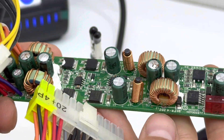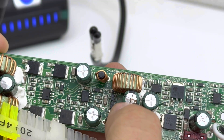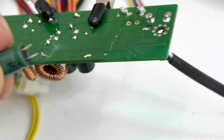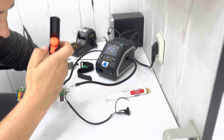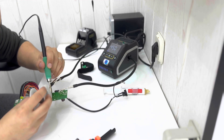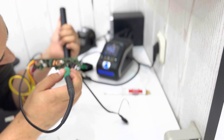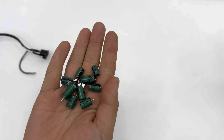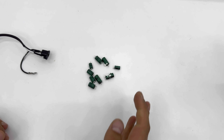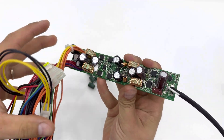Checking the board in a bit more detail, I could see that some of the capacitors were rusty and slightly bulged, so since there were only 10 of them I decided to spend some time desoldering and replacing them with brand new ones. These were unfortunately slightly larger but of correct specs. After retesting the voltages there was no change — replacing caps doesn't always solve your issue, and I'd just wasted my time and patience. There's probably some other component, possibly a transistor or inductor that has failed, but by this point I had already rage-quit and decided on using another PC as my base.